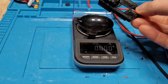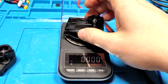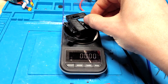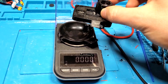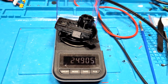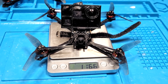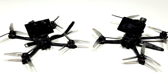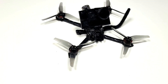With the integrated 45 degree angled mounts for the scythe frame, the TPU alone comes in at 7.5 grams, with a respectable all-up weight of 22.2 grams. The GoPro 7 TPU somehow ended up slightly lighter at 7.33 grams, but comes in at over 2.5 grams heavier with all electronics at 24.9 grams due to the longer lens. The dry weight on the scythe for the 8 is 116.6 grams, making the all-up weight about 176.6 grams with a 550 milliamp hour 4S battery.